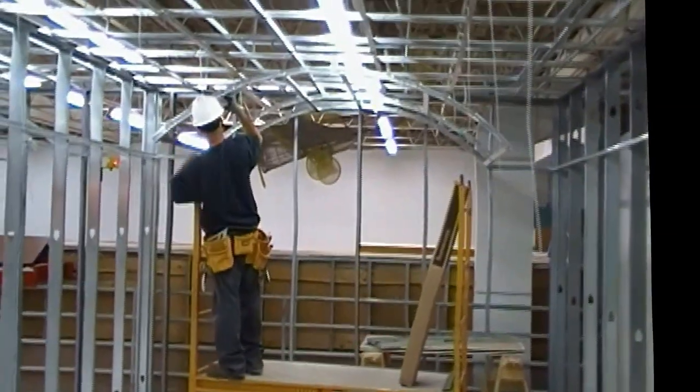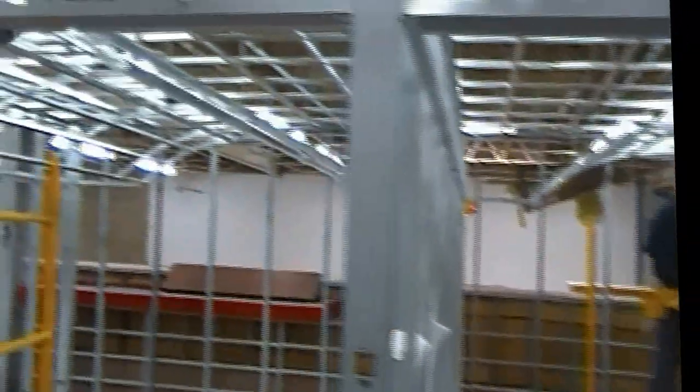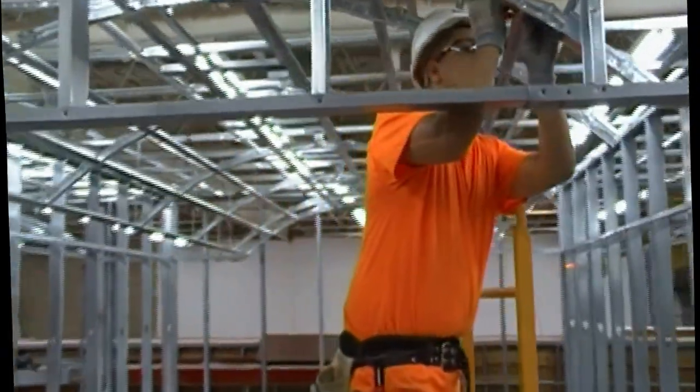In this class we will be showing you how to bend the ribs, install the tees, and figure out the hanger height. You guys will be building soffits connected to the ceilings.